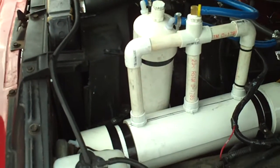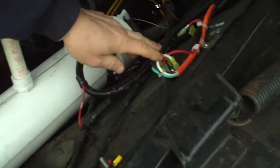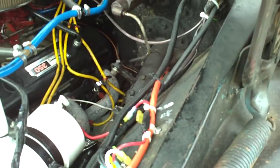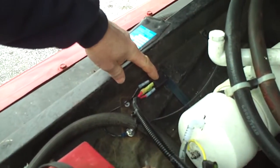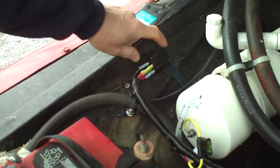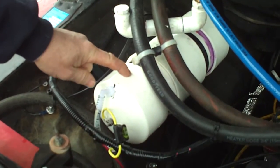What we'll look at right now is a little device right here which is a full bridge wave rectifier coming off of an inverter which we will show you. And then we have a small unit right here which is a master relay that takes energy off of the coil from the electronic ignition and allows it to control the turning on and off of this generator.